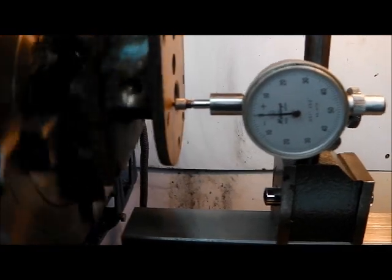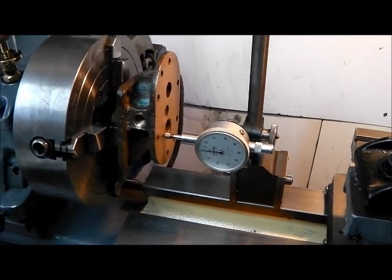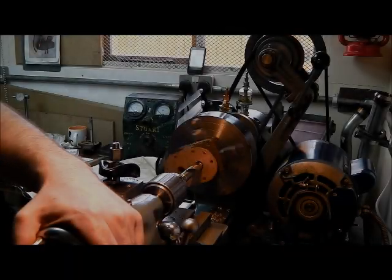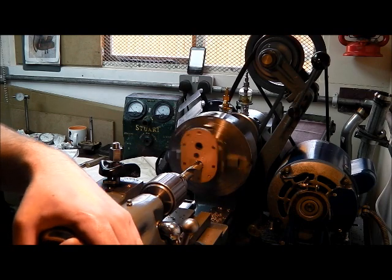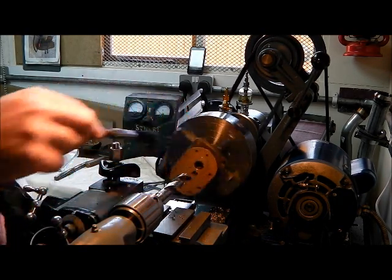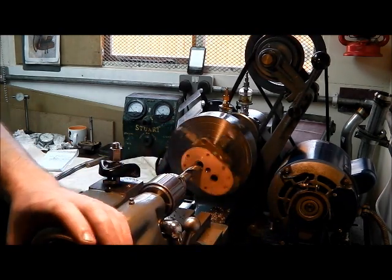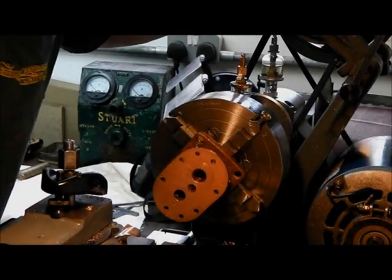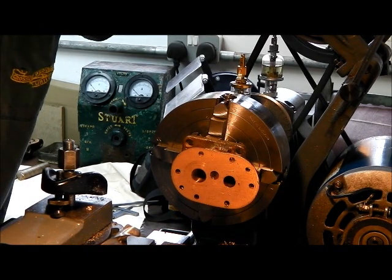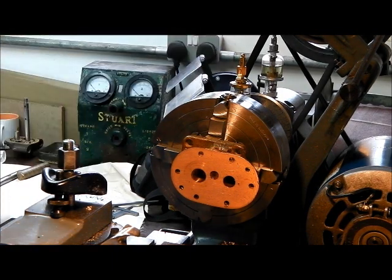We're ready to start boring now. I'm probably just going to use a drill in the tailstock, but if the drill wanders because of the oval effect I'll change over to a boring bar to get as near the final size as possible before using the reamer. We've got just over one thousandth of an inch run-out there, which I'm happy with — bearing in mind this is a fairly agricultural bit of kit, the pump not the lathe. It's quite a hard grade of bronze — I suspect it's probably phosphor bronze actually. The next stage is to get a boring bar in there, take it out to just under 750 — three-quarters of an inch — and finish off with the reamer in the tailstock.